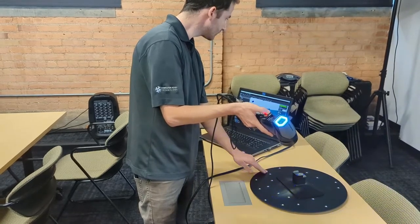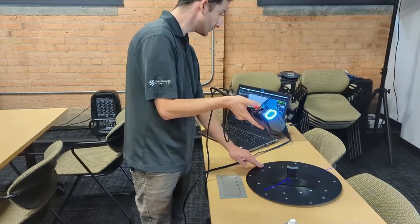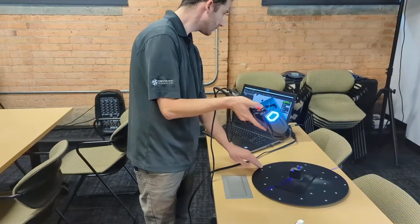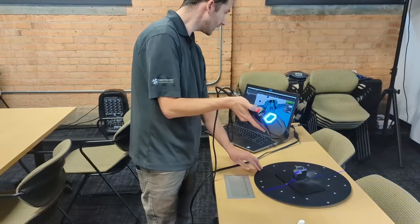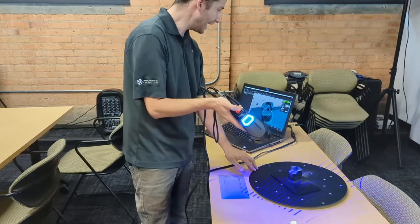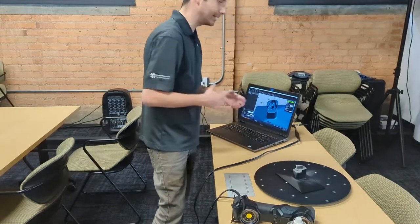So if somebody didn't have CAD data for their part and they needed it, you can do that with the 3D scanner as well, right? That's what I'm doing right now. Inspections too — to see how different a part is from the manufacturer's part. There's a piece of software called VX Inspect where we can apply the scan data we just took to the CAD file that was used to make the build head, and it can measure all those deviations for you.